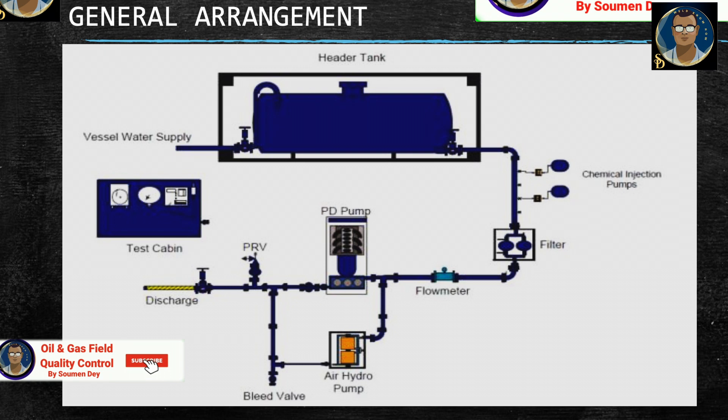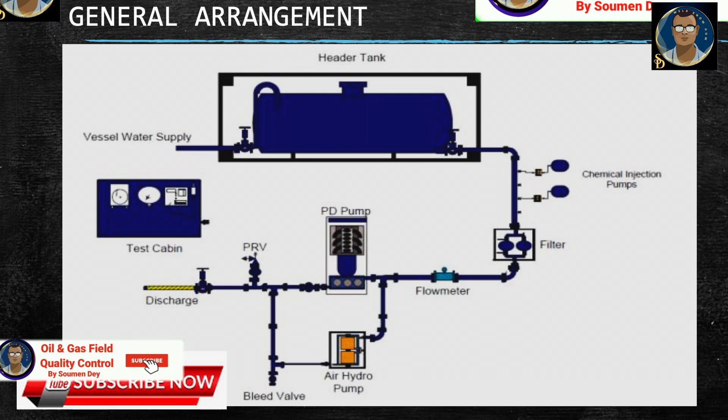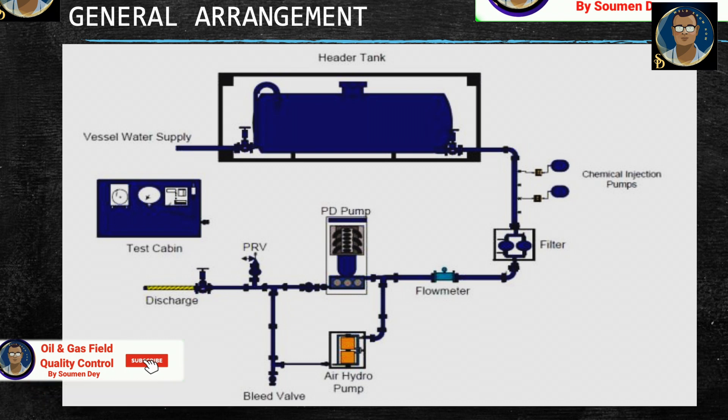With pressure stabilized, start the clock and monitor the pressure. Note that RTP pipe expands slightly during initial pressurization; it is therefore recommended that the pipe be allowed to stabilize to pressure for a period of time before beginning the actual test. The stabilization period is usually 30 minutes for up to 5,000 feet in length, but can be longer for greater lengths. Generally a slow pressure decline of less than 25 psi per hour is normal during stabilization — there is no need to be alarmed, as this does not indicate a pipe leak. Having excessive air in the line will also lengthen the stabilization period. Temperature changes cause the test fluid to expand or contract, resulting in changes in pressure, so ambient temperature should be tracked to provide compensation on pressure graphs.